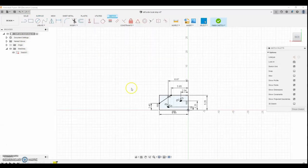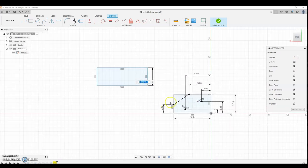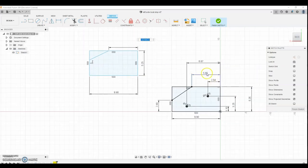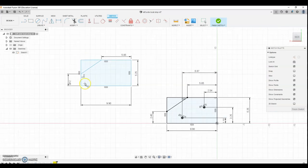I'm going to draw another sketch and show you what I did. After I took some measurements from the wood block, I came in and wrote down what I needed. The block is 5.25, the length is 9.9, and then to put this angle in, I drew a line across and trimmed to the rectangle. I dimensioned from the point to the end at 5.85, and from this point to the bottom at 2.4. You can also put points along the line and dimension them out, then connect the points — I just did the line because it's a couple fewer steps.